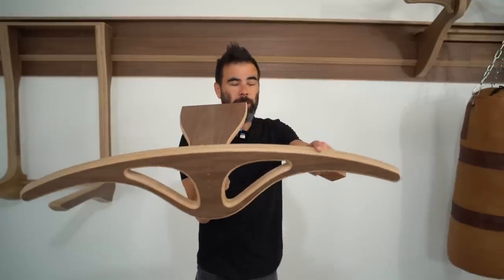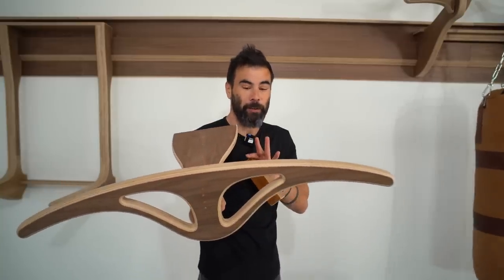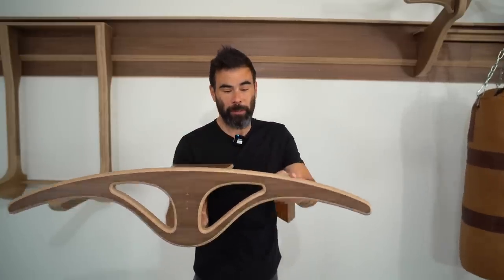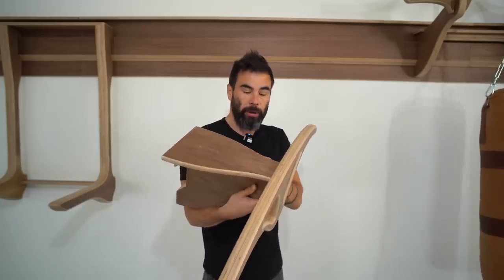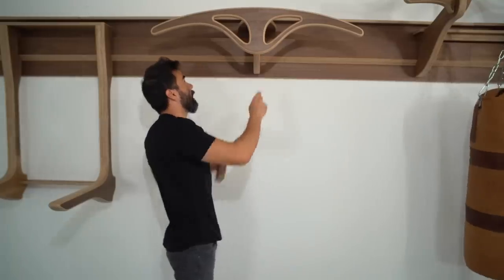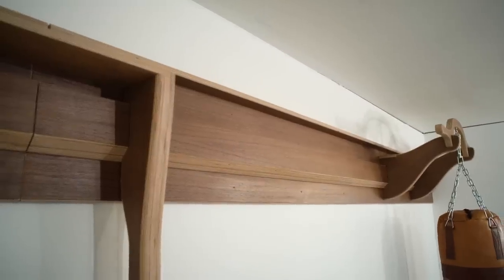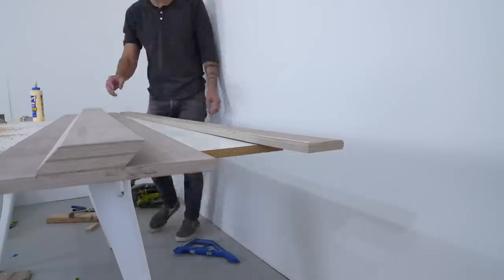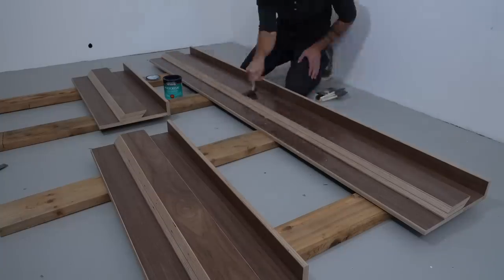The pull-up bar looks really cool and it's only two layers thick. I think this is plenty strong but we're going to test that. My prediction if it does fail — it won't be at the bar itself. This plywood has so many layers, it's quite strong. My prediction if it does fail would be some of these screws pulling out. I feel like it's pretty locked in solid on the French cleat detail and I really like these stop blocks that keep it from bouncing up. The track itself is in three pieces: a full long eight-foot section in the middle and then two shorter pieces to fill in the ends of the wall. It's one layer on the back, two layers for the French cleat, and then that top cap layer. It has two coats of polyurethane, but I predict it'll get a little scratched up — I can always buff that out and add another coat every five or six years.